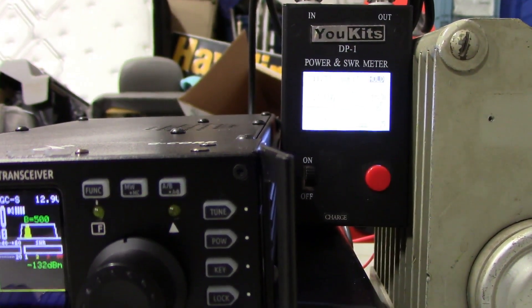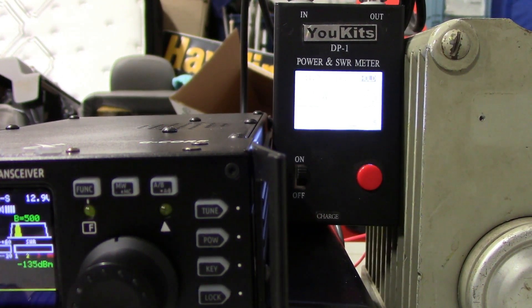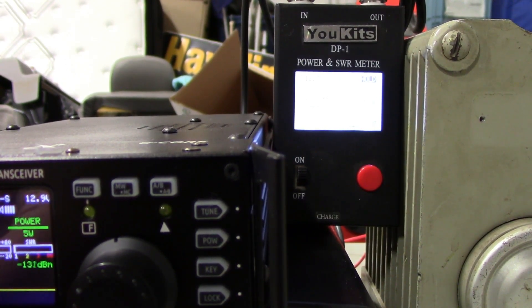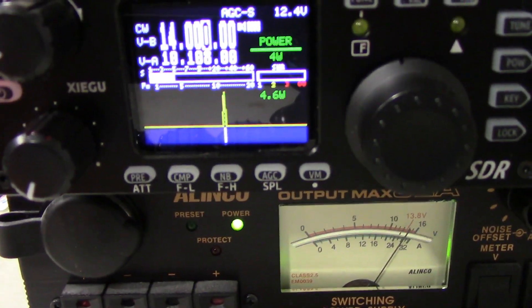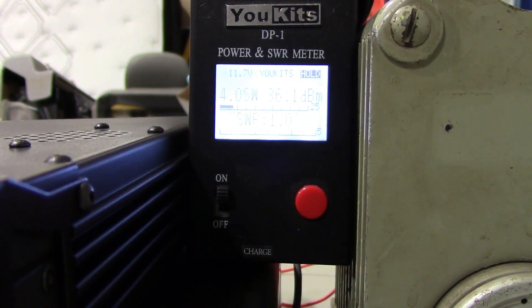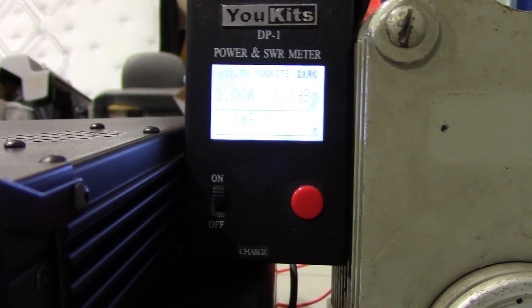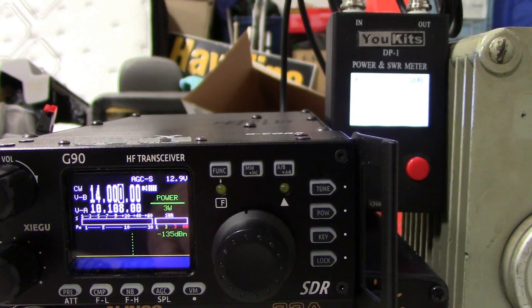So just a short test for you guys — I just wanted to show you some meter comparisons. So if I want to be transmitting QRP, which is 5 watts or less, I am going to have to be on the 4 watt setting, which even then shows 4.6 watts out on the radio, but on this outboard meter it is showing 5.2. If I go to the 3 watt setting, it shows that I'm at 4.08. So a little bit of give and take here. Thanks for watching. This is Fred, VE3FAL, Ontario Northwest Bushcrafter and Outdoors. 73, guys.